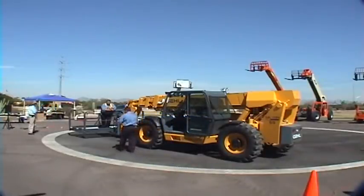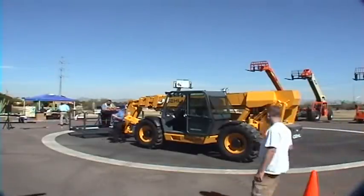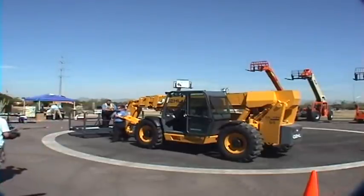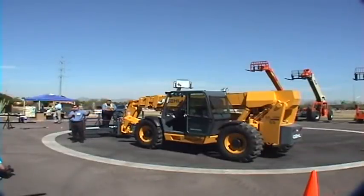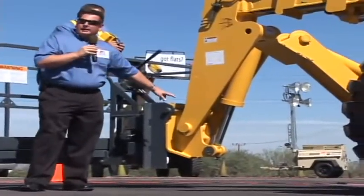The Gehl DL series is kind of unique in many facets. One is that we have the ability to do a selective boom, so you can either take a high profile mounted boom or a low profile mounted boom, as well as various lengths you can select, whether it be a 44 foot 10K or a 55 foot 10K, and on right down through the product family. One of the things that we do offer too is also two mounting tool systems.